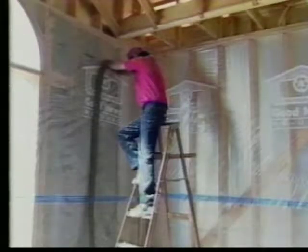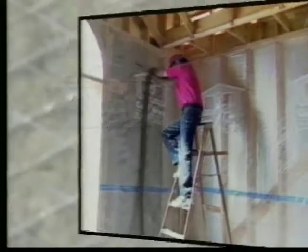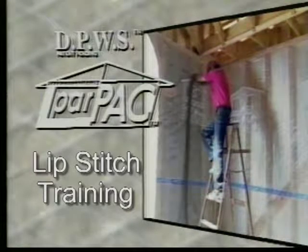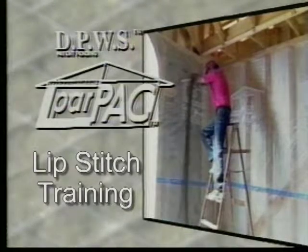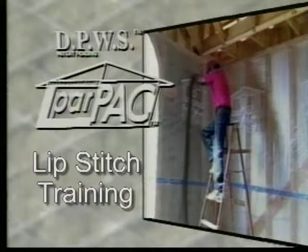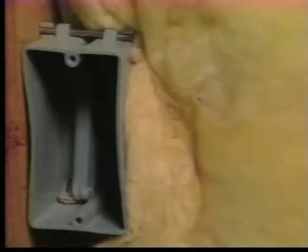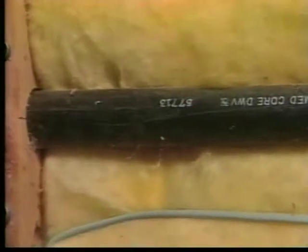Finally, an innovative, revolutionary new application system for cellulose insulation has evolved, called the Dry Pack Wall System from Parpack. This new system is simple, competitive, and best of all, it plugs the leaks. That will save you precious energy dollars. Batt-type insulation's R factor is affected by voids and by compaction, or stuffing the batt tighter than design specifications allow.